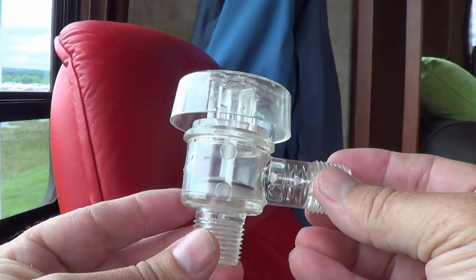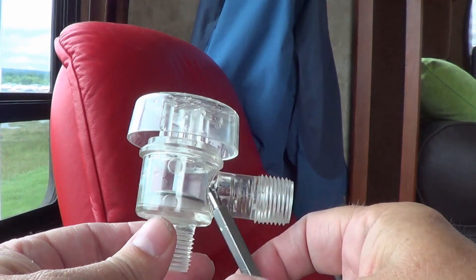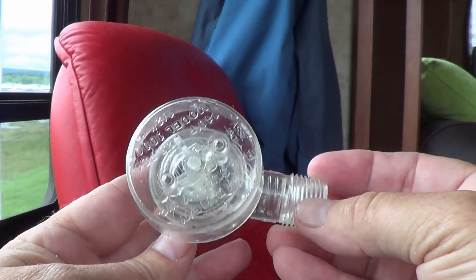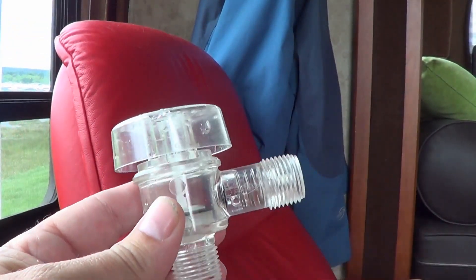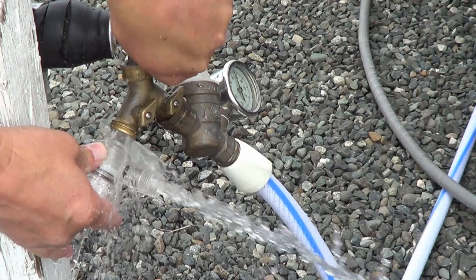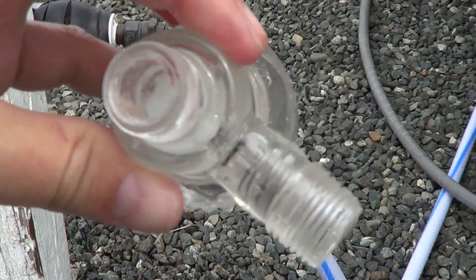Also when it's freezing, when you pull the pressure off, this side drains back into the tank and this side drains out the hose. I have heard of water getting trapped in here before — just enough water that this thing cracks. So then the next year, people go to flush their tank and they go inside and get a nasty surprise when the bathroom is flooding. Anyway, it looks to be okay, definitely this part's working. Let me put some water pressure on that and see if it shoots out the other side. Well, that seems to work — the old spring depresses and it shoots water out.